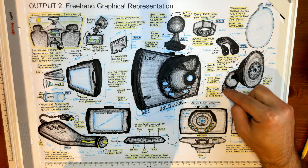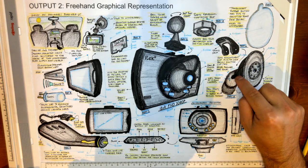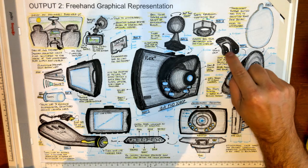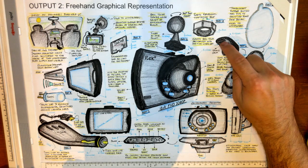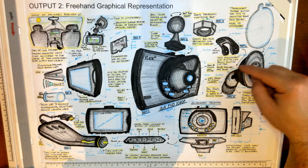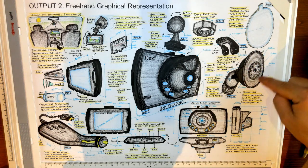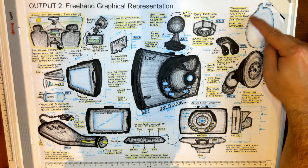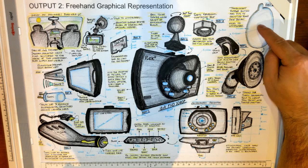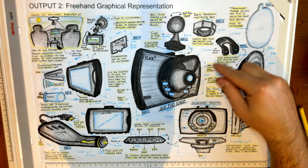There's a tiny slot on the neck of this mounting block. There's a very small hole — you can't really see it on screen because of the darkness — but imagine a set of small plastic dowels sitting out that actually feed into these holes. This has a little thumb grip on the other side and it allows you to clip and lock the suction into position. It'll move slightly forward, slightly back, giving pressure onto the suction pressure plate here, at the top end of the suction block. And you can see I have the actual translucent rubber that fits directly on top of that, adhered using adhesive. As you create the suction and use the clip, it fits against the screen and creates the suction.